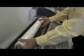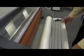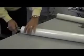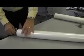To remove the film shaft or change rolls of film, the film shafts slide to the right and easily lift out of the machine. To remove the bottom film, lift off the feed table and again slide out the shaft. Take the film shaft, slide it into the core of the roll of film, and push the core adapter firmly into place.